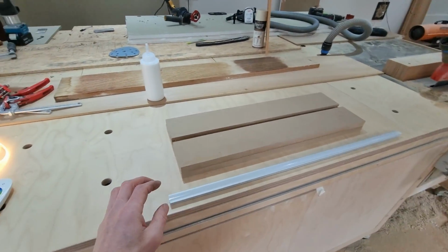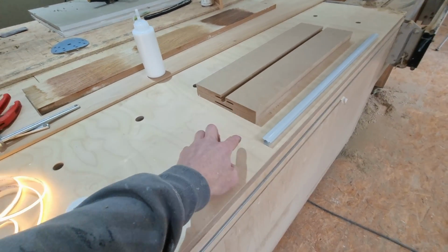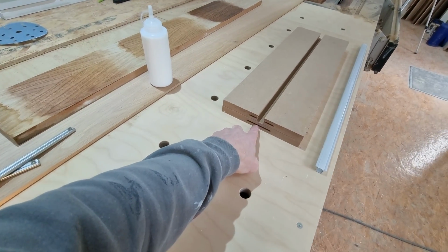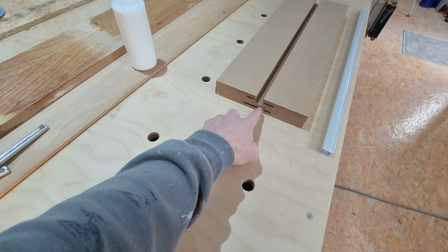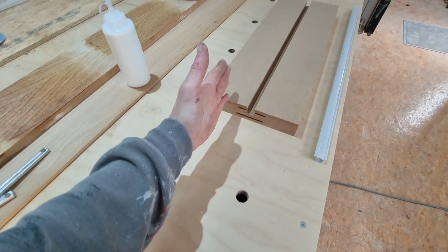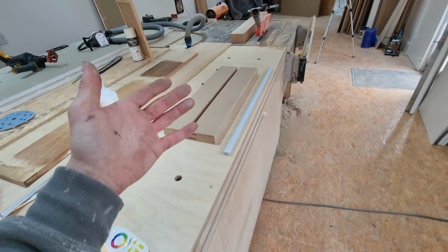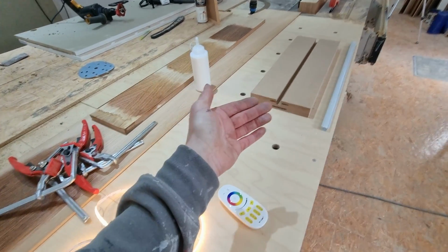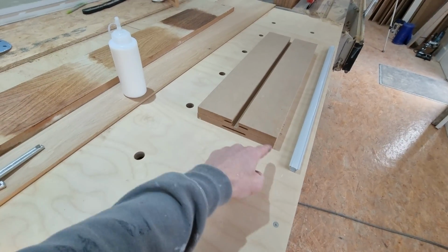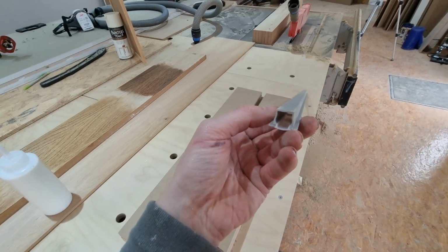We generally make the shelves out of 18mm, and in this video we're using 2 pieces of 18mm. At the moment, we've got a shelf of 200mm. Forget about these slots, by the way, they're just offcuts. I try to put the light centrally in the shelf. It just gives you the best glow. Over all the times I've made shelves, this is what I like the most. If we've got 200 overall depth of the shelf, we need to take into account that this channel is roughly 15 millimeters.